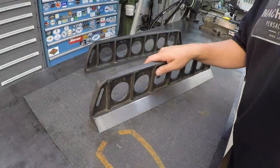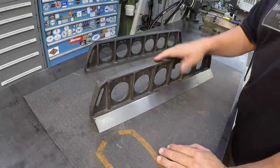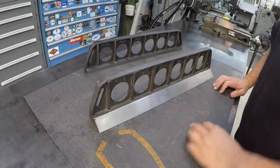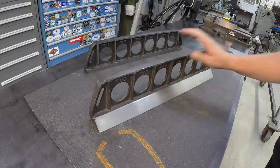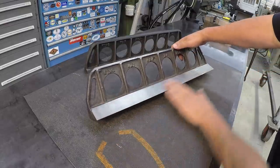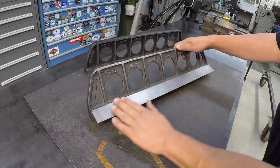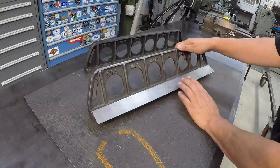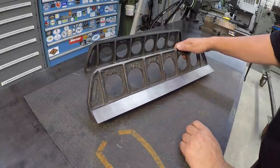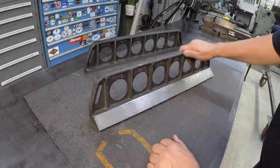All right, guys, all the machining and the filing and deburring, everything's done on both of these straight edges here. And so this part of the project is now complete. I told you I wanted this to be a shaping project, and that's just what that was. I would have liked to have a better finish on this angle right here, so this is something I've got to experiment with more, and play around with some of my tool grinds and the tool geometry when I'm coming in on an angle like that to cut that. But this will be fine.